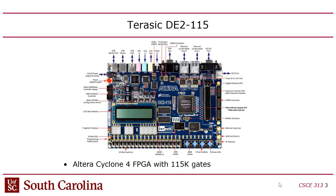We're using FPGA boards. An FPGA by itself is useless even if you can configure it, because it has to be connected to peripherals. The reason we chose this board is because it's got a ton of peripherals and it's almost indestructible — as opposed to the Atmel chips we used two years ago in this class, which were very destructible.